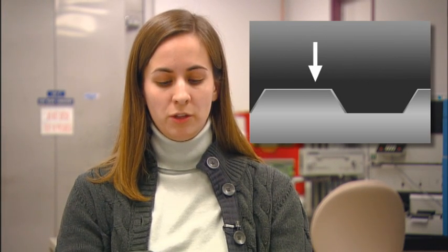You have two planes: a sloped plane and the top surface plane, both defined by the crystal structure in the silicon. They're intrinsic, so they don't change — they're the same on every wafer and the angle between them doesn't change. We touch with the CMM on the side and on the top, intersect those two planes, and find the edge. That same edge is clearly visible under a vision system because light reflects back from the top surface while the sloped surface reflects light away, so it doesn't get seen by the optical system. That's how we go from the mechanical touch system defining the edge to the optical system locating it.